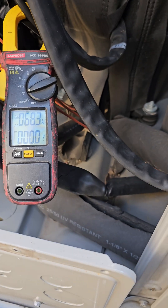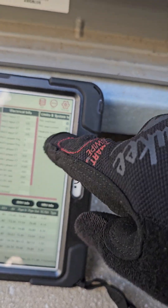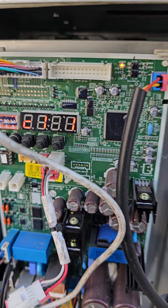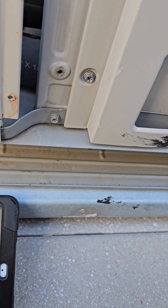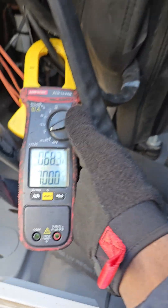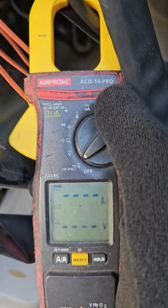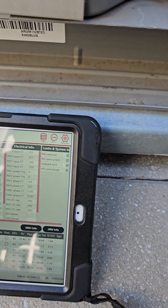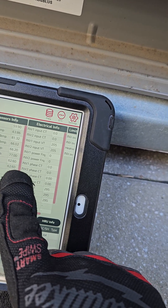Starting up — hold the peak in TRMS mode. So yeah, that got caught and I didn't even see it over here, it didn't register right here, and the error is already up. But my meter caught it. When I play the data back, I'll catch it too. But yeah, I can see it right there — 68 amps. 68 amps and it's locked out. The second compressor is not even on — it just locked out.